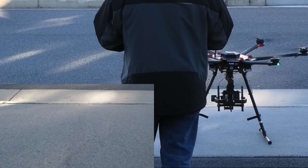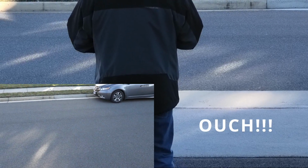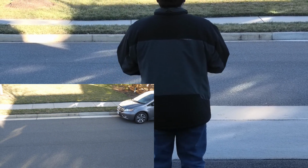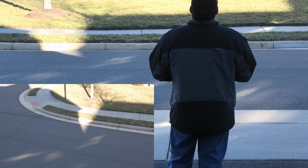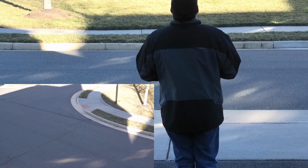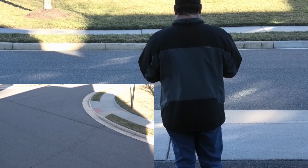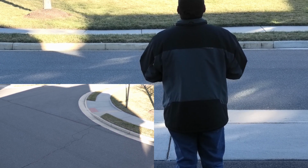So this is where I had not yet realized, I'm sorry, that my landing gear switch was actually in the up position. So even though the landing gear was physically down, once the drone was powered up, it actually tried to retract the landing gear right away. And the little hop, skip, and a jump off to the right should have been my first indication, but I didn't quite know. I thought maybe it was a small gust of wind that came along to push it sideways.